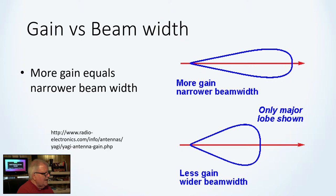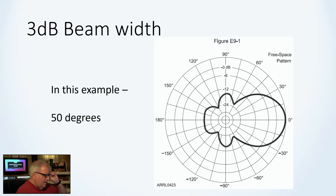Or what is it? You'll see these patterns being provided by manufacturers, and they may ask you, what is the 3 dB beam width of this antenna? What is the half power point? Well, if we notice on this scale up here, there's the 3 dB below reference. This is the reference line. 3 dB below, 6 dB below, 12 dB below, 24 dB below,